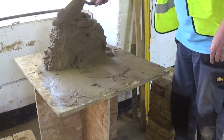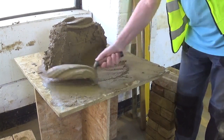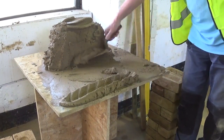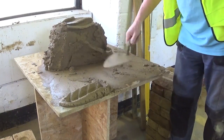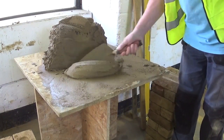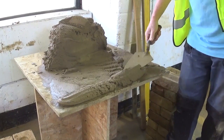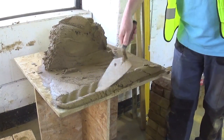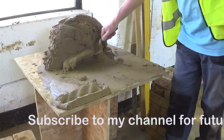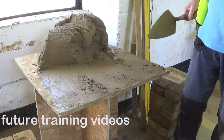Go through that again — just watch it slowly. I'm slicing off the side of the trowel. Turn the trowel over sometimes and throw it through if you want. You'll follow it with your own technique. Slice it through, roll the mortar, side of the trowel, and then flick. I'm going to cut the top off and turn it in. What I'm going to do now is try where to lay and butter your first brick.